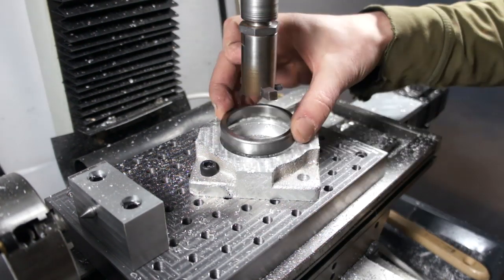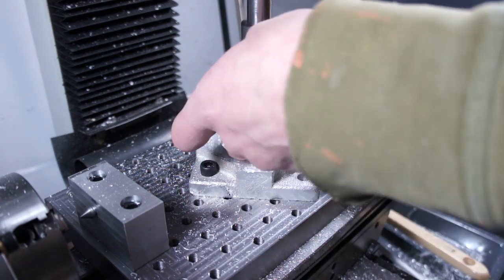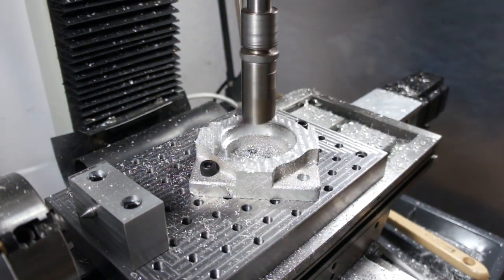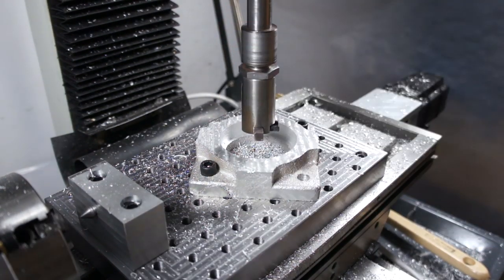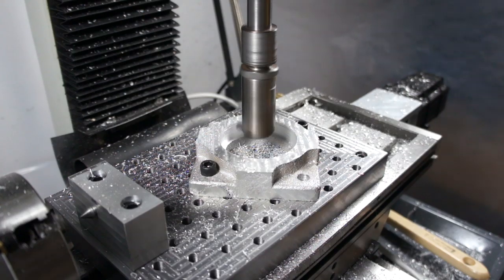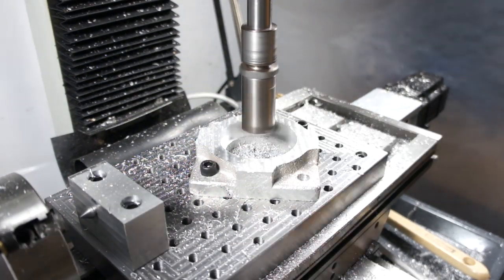What I'm doing is cutting, then checking the size with the outer race, loosening the set screws, and just tapping lightly with a hammer to keep knocking that little cutting tool outwards more until I get a nice fit. It's actually very easy to adjust it to within just a few thou with that method — I've done it in the past and was amazed at how well it works. We got a really nice fit on both parts and I was very impressed with how easy this was to do.